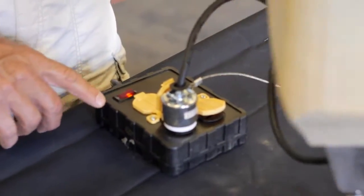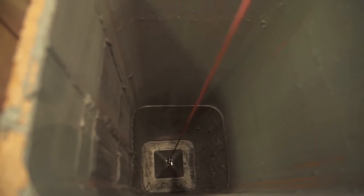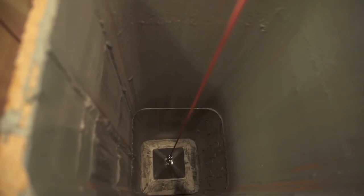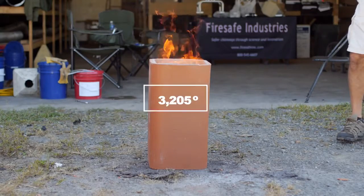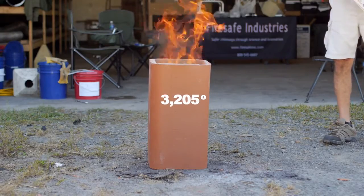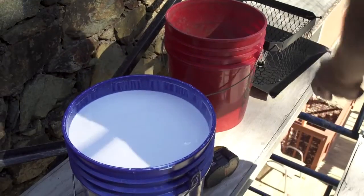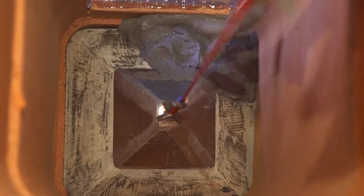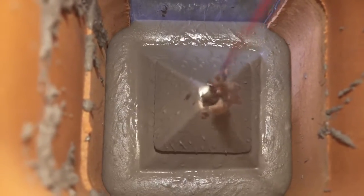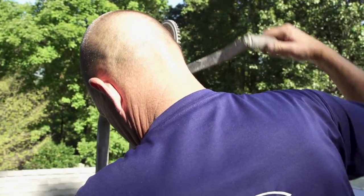Without pinpoint vibration, the ceramics do not penetrate tight openings, nor form a solid, consistent coating over surfaces. FireGuard's temperature rating — 3,205 degrees Fahrenheit — is the highest rating in the industry. The unique chemical and physical properties of FireGuard's ceramic material and the method by which it is applied produce heat, acid, and water-resistant surfaces that decrease dangerous heat transfer and virtually eliminate gas seepage through the flue liners.